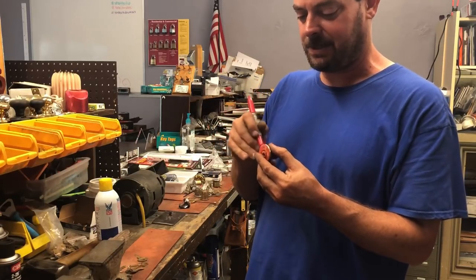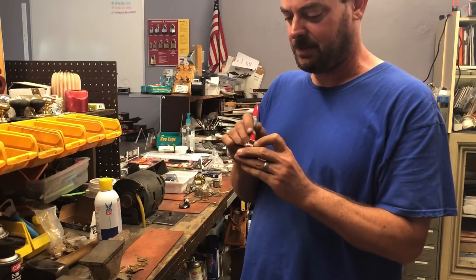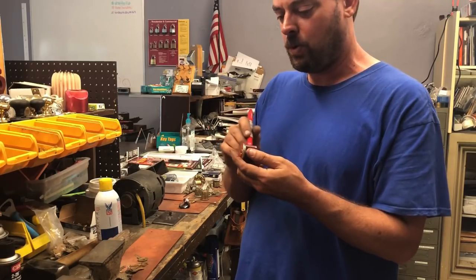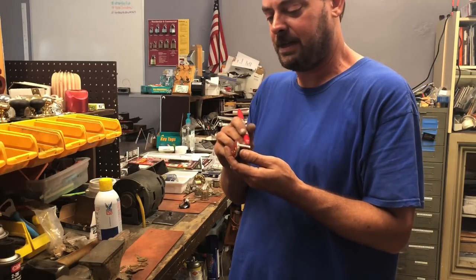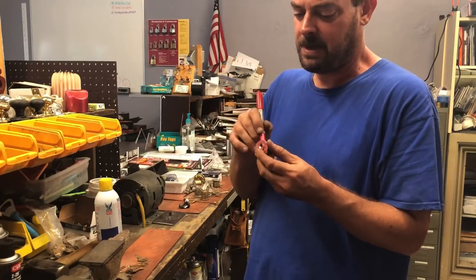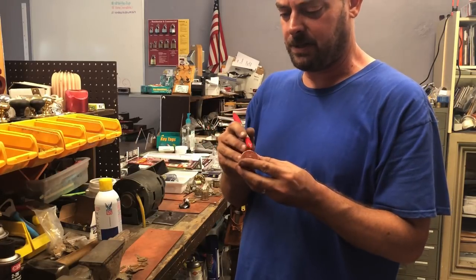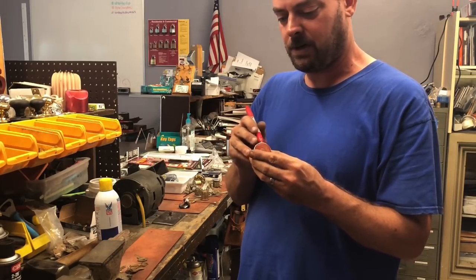Good idea to get you a key checker. It's pretty easy to get these cylinders. As long as you find one in real decent condition, not wallowed out real bad. Typically, most people don't replace their stuff until it starts getting worn or broken. But every so often, like on a double cylinder deadbolt where they've never used it from the outside and it's worn on the inside or broken, like the back plug breaks and it has to be replaced, and they've literally never used the key from the outside, probably you'll need lubrication. But otherwise, the cylinder, the key chamber part is good. Take it apart and make sure somebody hasn't routed it with a drill bit to make it work.